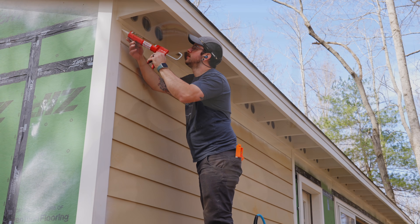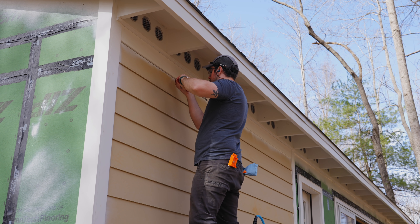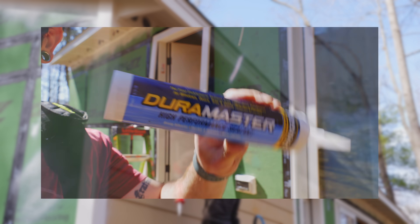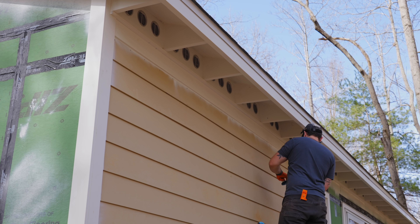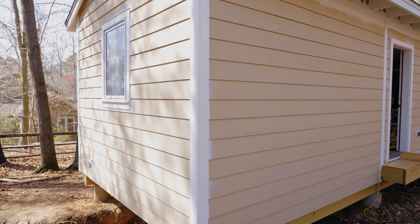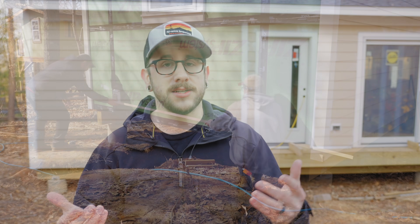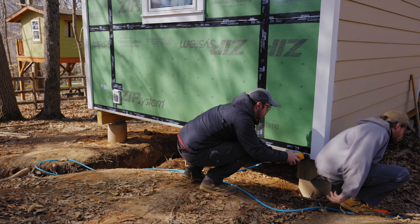After that last row was in place, we caulked the seams between the upper trim and the vertical trim. We used a combination of Weathermaster and Duramaster caulks, both made by Titebond. Duramaster is an elastomeric water-based sealant, which means it stays flexible over time but can be cleaned up with water — a great choice for siding work. Moving to the next section, we used a line level to wrap around corners, making sure all siding runs at a consistent level all the way around the house. We again used the trim board bottom edges as reference, cutting a starter strip and getting that first row installed.